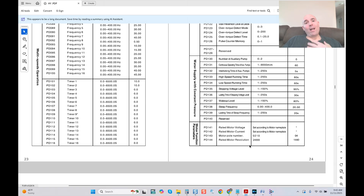If this occurs and I catch it, I'm a vendor that believes in updating the information so guys don't struggle. I don't know why no one else has caught this, but it's something I just caught and therefore I'm updating. As far as that PD070 setting — where we're supposed to use the pot and hit 0 to 10 volts — now we know how to troubleshoot that. Switching that setting from 0 to 1, as we just demonstrated, will bring that spindle to operating at 400 hertz, aka 24,000 RPM. There should never be a deviation in the user's manual — unfortunately, it happens to a lot of companies.